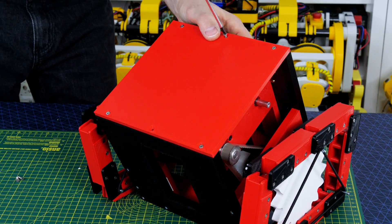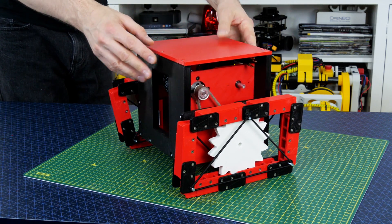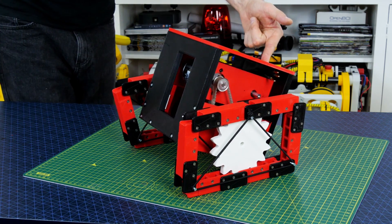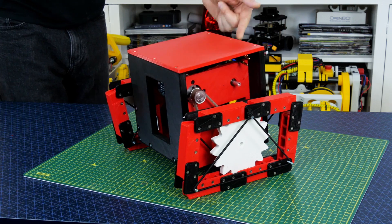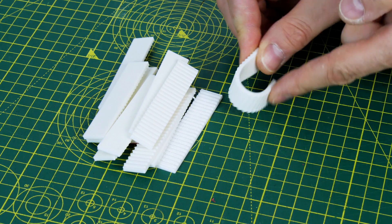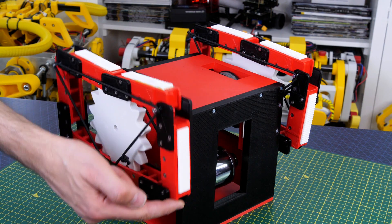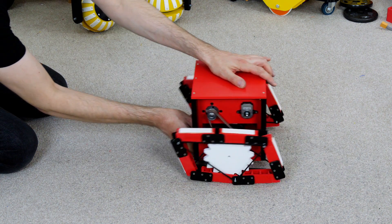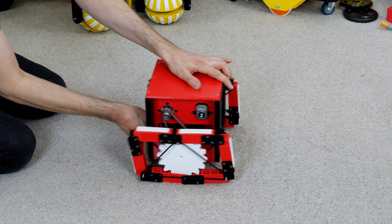There's a lid that screws on the top where we'll mount some of the electronics. There's actually quite a lot of friction in that drivetrain so it will stand up by itself statically — however, as we start driving it's just going to tip over, so we need electronics to actively control the stability. I decided the tracks were a bit smooth, so I've printed some flexible TPU treads which I've glued on all over, and that's quite important for good traction with a balancing robot. Pushing it along, we've got lots of traction and we can back-drive that mechanism, so it seems pretty okay.